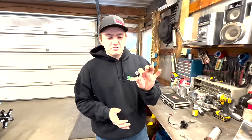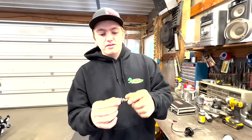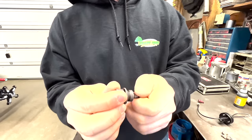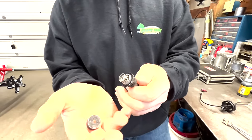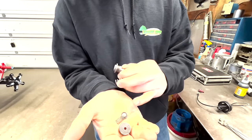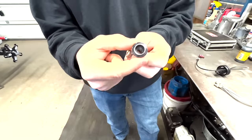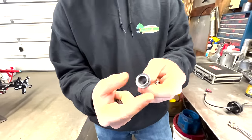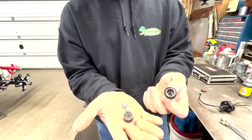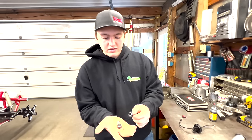So these are the quick-change originals. I'll pull this apart here for you. This big one here is going to be the locking nut, and this is the adjuster — you just back it off. Be careful because there's springs in here. You've got the adjuster out, got the springs out — there's two of them. They come apart just like that. Then the diaphragm comes out, and that little diaphragm sits right in there. To clean them, we take a rag with some Simple Green, pull this all the way off, go over everything on there, then clean everything back up and put it all back together.